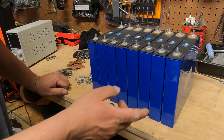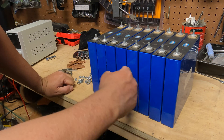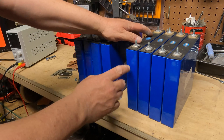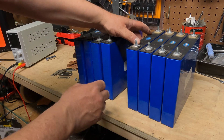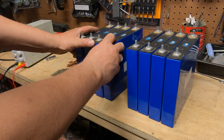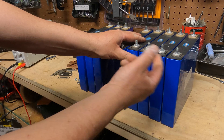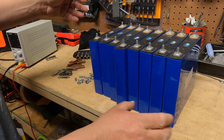We're making a 24 volt battery because there are eight cells. This is what's called an 8S battery and that makes a 24 volt nominal battery. If we were to split this in half we could actually make a 12 volt 4S battery, and if we wanted we could make it a 2P 4S 12 volt battery by putting them in parallel first and then in series. There are a lot of different ways you can do it, but let's keep it simple.